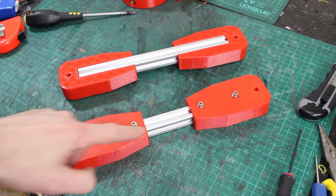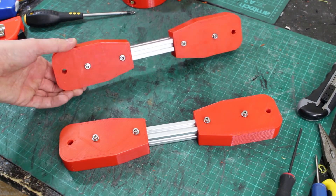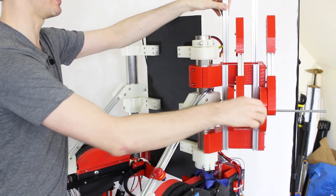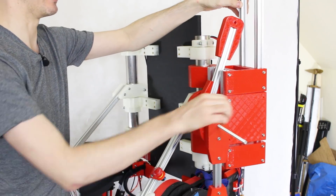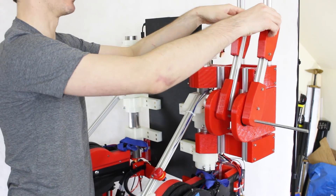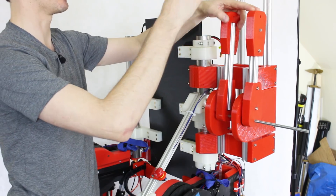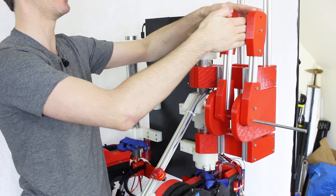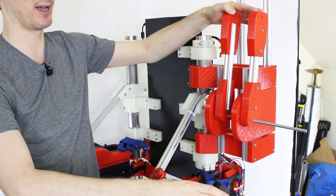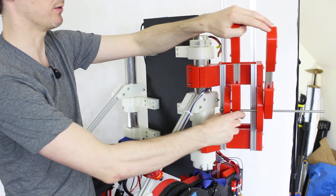Here are the left and right parts for each arm — each attached to a piece of 20-20 with those T-nuts again. I've just loosely fitted one side here so we can see it rotate; those will be fixed properly in the ends. The two arm pieces aren't fully fixed yet, but this makes the top of the shoulder. My arm comes down this way, so we need to make a shoulder piece before fixing these together, as it goes in the middle. That piece will have bearings, coming down to make my elbow — and that allows me to lean forward and also lean the arm outward.